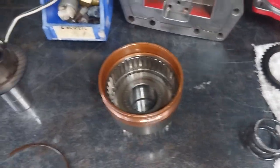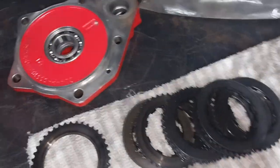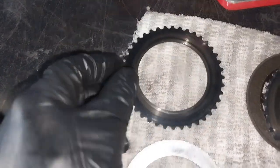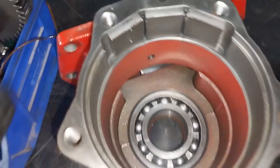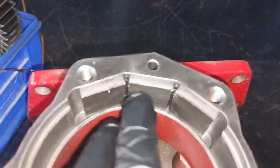So rather than put it back together, I decided in my years of wisdom to strip it down and to see why it wasn't disengaging. We've discovered some interesting things. I believe that this once upon a time looked like that and something has gone wrong there. There's a lot of scoring on here. I believe this scoring is from all the contaminants that were built up on this magnet here — these were fuzzy with metal shavings.